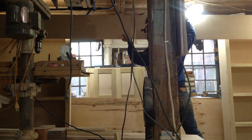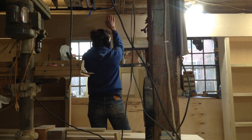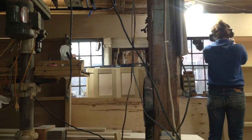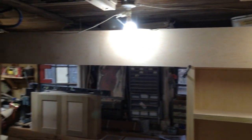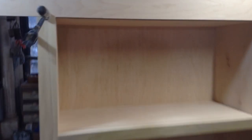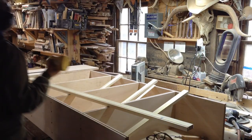And I could kind of get this above, and then into place on top of those two bookshelves. So I was really happy with how this fit. They lined up perfectly. All of my stiles were right. There were no big gaps, and it went right across the top of the shelves. You could see some light shining through on that one, but that was just because it was out of place at that moment. You can see it lines up just about perfectly. My stiles were a little long — I trimmed them down before I glued all this stuff together, and that fixed that problem.